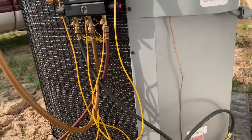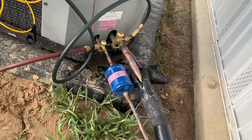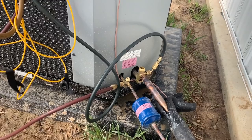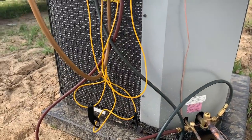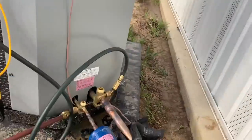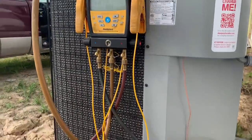All right, our leak repair is successful. We put a good bead. Really, all I had to do was roll the solder that he didn't roll, but I went ahead and put a little bit on there with a stick. I've got to get me a new Appion hose and use a micron gauge down there. I like doing the one hose Appion through the suction line, and I may get the True Blue. I don't know yet. We'll see.